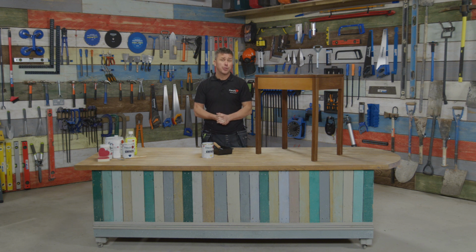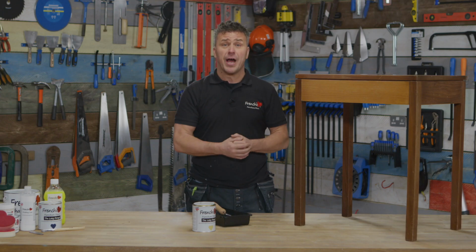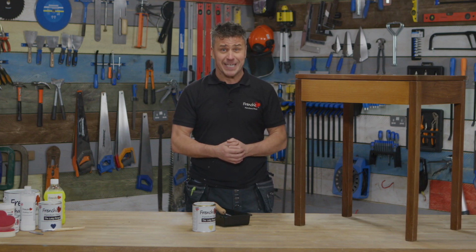In this video, I'm going to show you the basic tips on how to paint a piece of furniture. I've already done the preparation on this, so you can watch that on another video on Frenchic TV, the YouTube channel. All I had to do was clean it up with a sugar soap, dry it off, sand it down, make sure it's dry and dust free, and then you're ready to start painting.